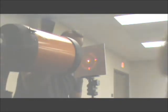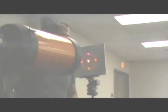Observe how the inner tips of the laser crosshairs are cropped by the secondary mirror assembly and are shifted to the left. This means that the secondary mirror is not positioned properly. It is absolutely essential that the secondary mirror is positioned in the center of the primary optical axis. Some scopes, for example the Celestron Edge HD, have built-in corrector plate adjustments, a very good feature. In other scopes, you will hold and shift the secondary mirror to adjust until all 4 inner crosshair tips are symmetric on the same concentric ring. Loosen up the shift adjustment screws.